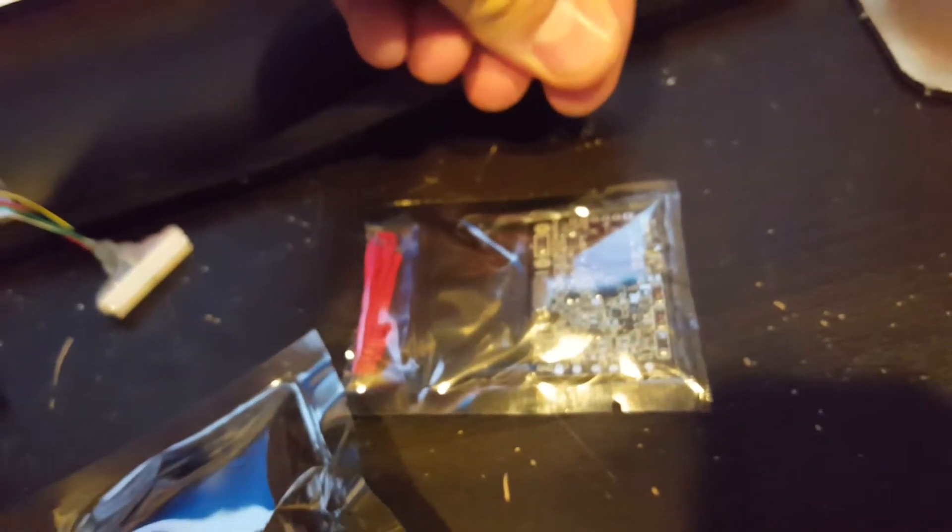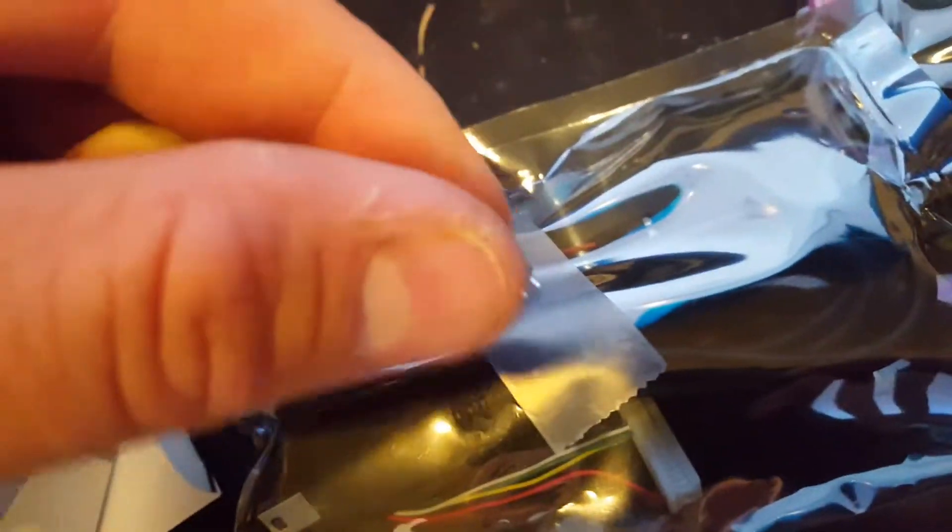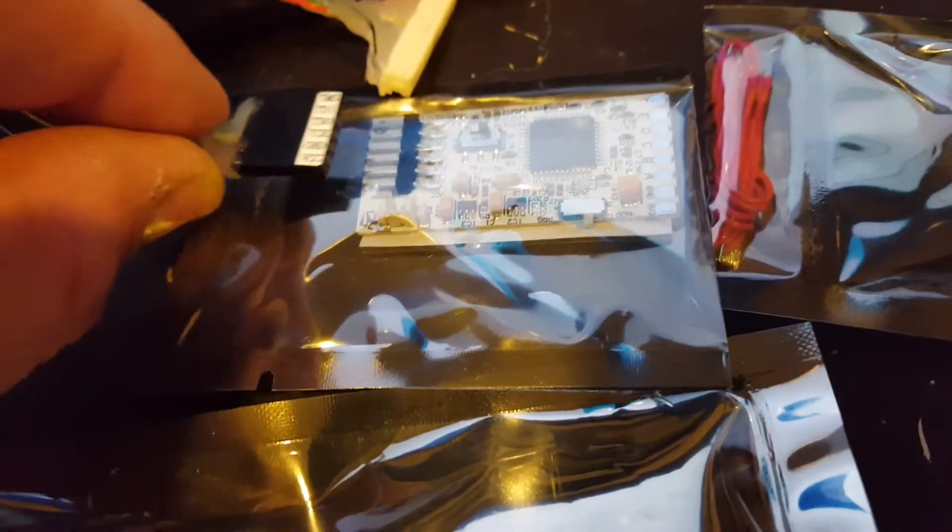You just insert it with those pins, give it a little bit of sideways pressure, and you can program it without having to solder to the ACE chip in this tiny little configuration — which is just a hassle. So you get this little useful deal, and then you can always just slide it back out. And if you need to program a CoolRunner Rev-C chip, the cable still works to just slide right on those, or any of the other Team Executor style stuff.